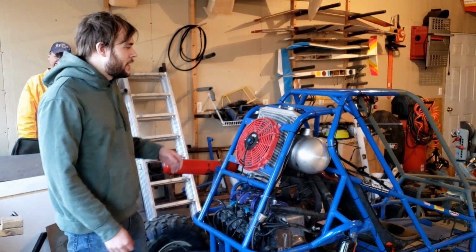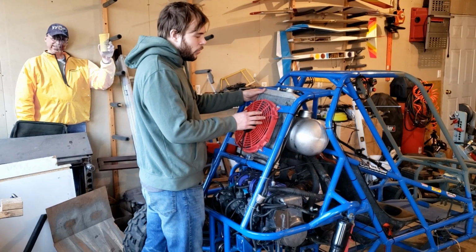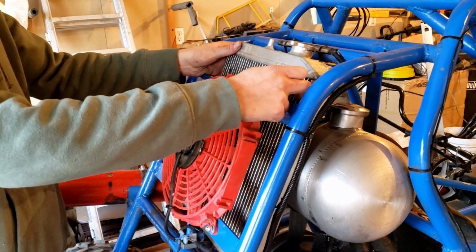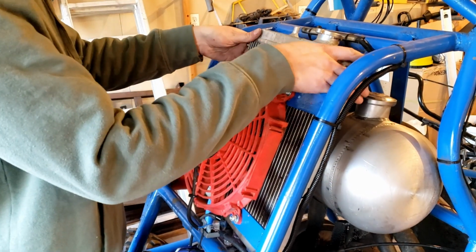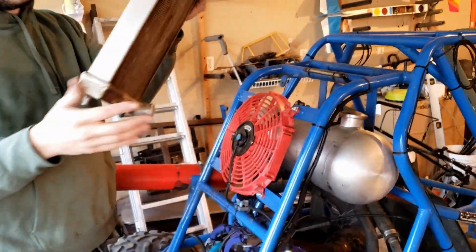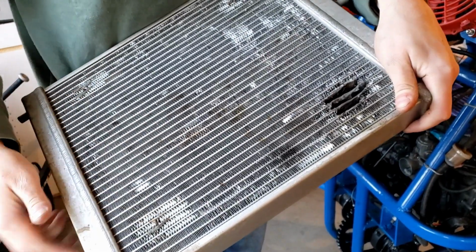It's time to change the radiator. Because we got some holes in it, and the reason why we had the holes was because we mounted the fan directly onto the radiator per the instructions, but it kept shaking around too much and it kept poking holes in it. So what we ended up doing is we had to put some JB Weld here and then down here, but